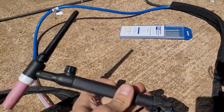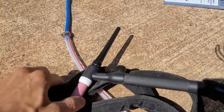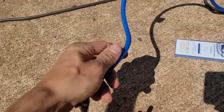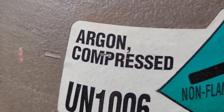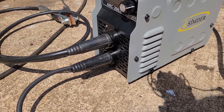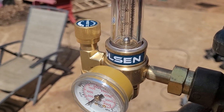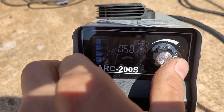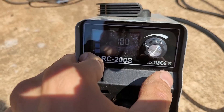Here's the setup. I got this TIG torch I had laying around. The torch I'm using is a WP17V. If you want to TIG with this thing, you've got to buy your own torch — it doesn't come with one. It goes from my flow meter down into this little tube and in here. It's got this manual valve right here to open it to let the argon flow out. I'm using pure argon. It's got the lead and the gas hookup going through it like this, then it just plugs right in. Lanthanated blue, 3/32nd TIG electrodes, 3/32nd filler rod, 11 CFH flow rate, and I just got some mild carbon steel here. It's on lift TIG, goes to 120. We'll try 100 amps.